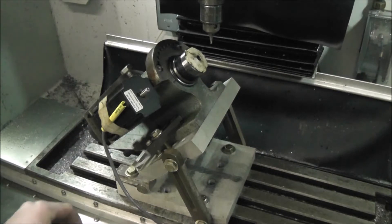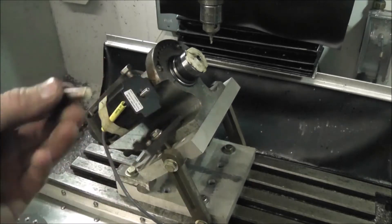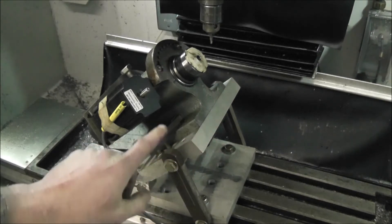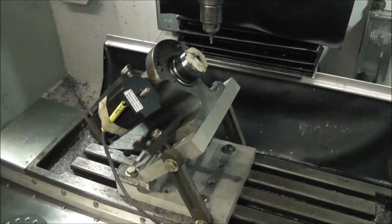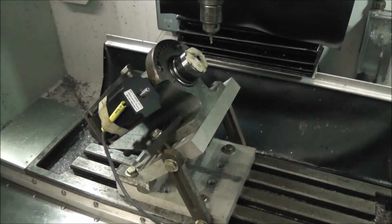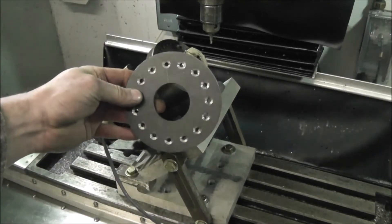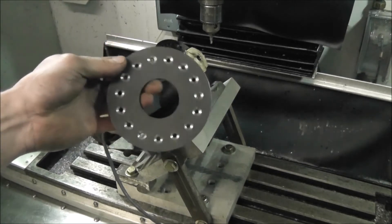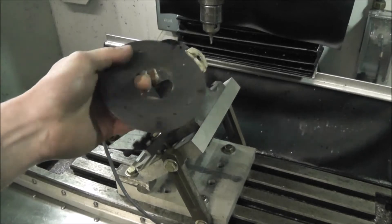I'm going to be using silicon bronze material for the gear. For the setup I have a homemade sine plate with a spinning indexer, a stepper motor, and a two-to-one belt reduction on the back. This really isn't any good for anything over an inch — it tends to move around a lot. I used to make these by hand using a homemade indexer plate, which would take me at least 10 minutes. Now with CNC it's down to less than a minute.